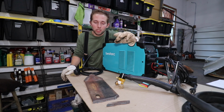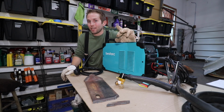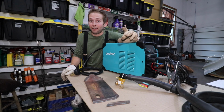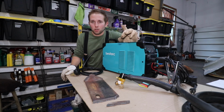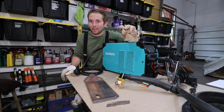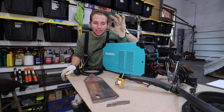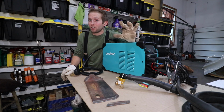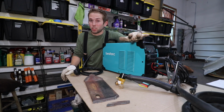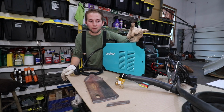Where I feel this machine would do very well is when you're on 220, 230 voltage and you're cutting anything less than a 1/2 inch thick. When you start going above that, I'd be a little bit leery about tripping the circuit breaker at that point. I'm not going to test it. I'm not going to push my luck. Just, I think 1/2 inch plate and thinner, 220, 230 voltage, you're going to be safe. You're going to be a very satisfied user. So that is my recommendation.